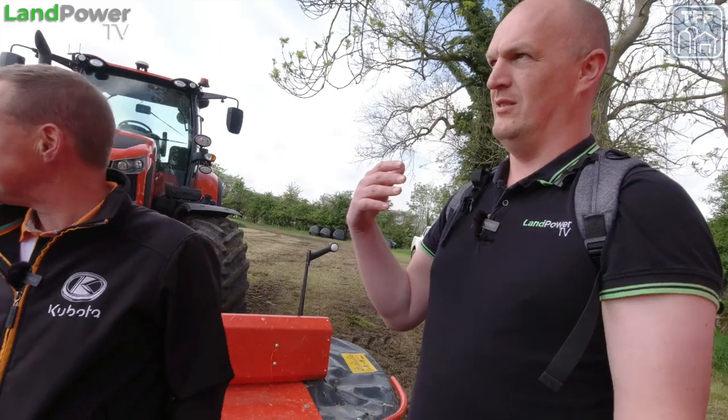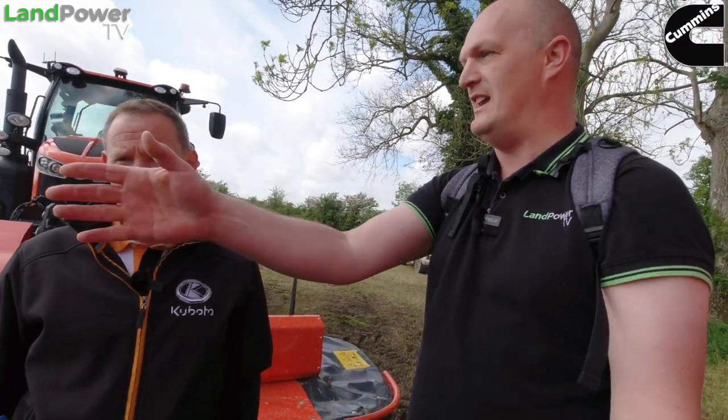Well, that's it, because as an operator, you're driving proactively, aren't you? Because you can see the swath up front that's getting heavier. You know to back off before you get to that lump. Exactly right. Whereas something that's just load sensing, you've already hit the lump and it's reactive then. So I suppose you've got all that to take into account. And how do you do that?